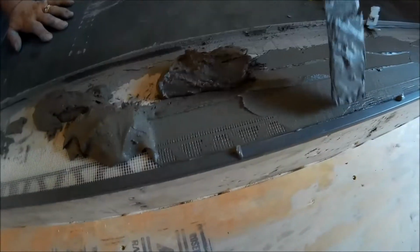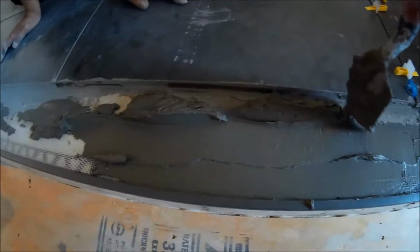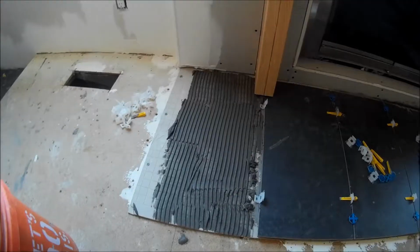You are supposed to stuff that full of the thin set, but you need to get it to stick in place first so I can start measuring and cutting tiles. So I'm laying a bed of mortar down first and see if that will help stick it in place. There's a little trick or tip that I'm using. Real tile setters will probably have something different to do with this, I don't know. But yeah, that's what I'm up to. Hope you learned something from that.